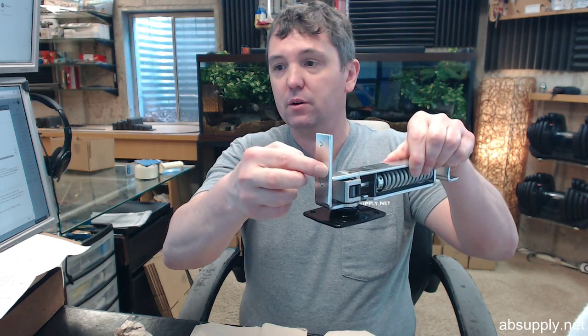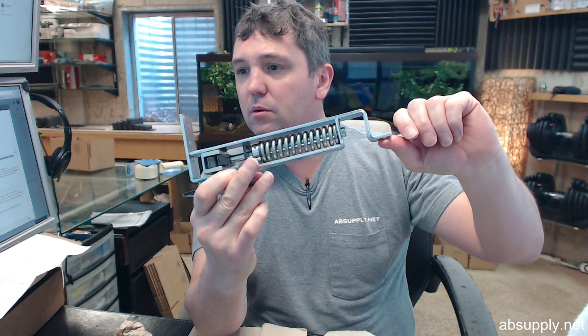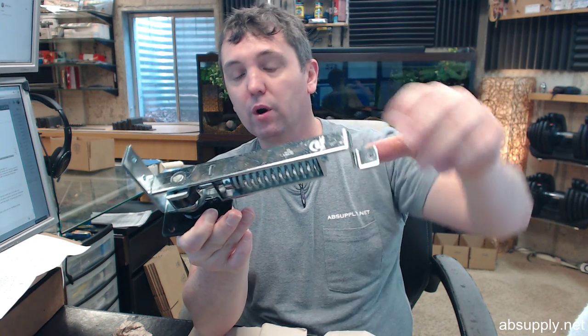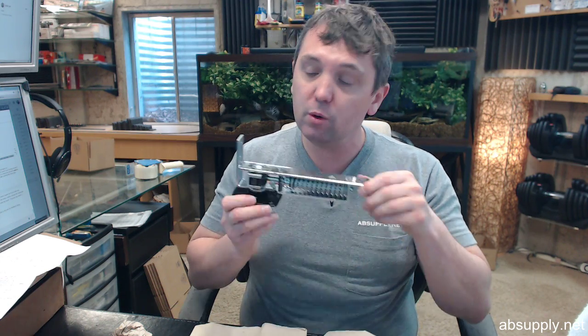Okay. Step 4 is going to help us with attaching it to the bottom of the door. You're going to use your unfinished screws that'll be in this package for attaching your 2 screws here and here, your 1 little screw down here in the tab. They show a screw here as well that will secure it to the door. Before you go drilling anything, pre-drilling holes and attaching it, make sure you just have a nice, tight, fast, clean, flush fit to the bottom of the door. Once you do, attach it.